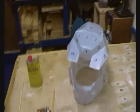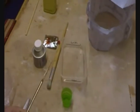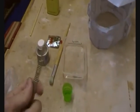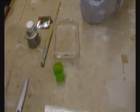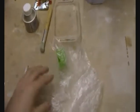Okay, what else would you need before we start fiberglassing? Well, you need a clean area. As you've been cutting the mat, you can cut it with normal scissors into the shapes. The craft knives aren't really too useful for this stuff, to be honest, but when it's a bit thicker you could use one to tidy up the edges, which is why I've got them out here. In addition, I've got some disposable gloves. Obviously you will need gloves when you fiberglass. These are disposable and just as good as the rubber gloves that people tend to use, as long as they cover the hand.